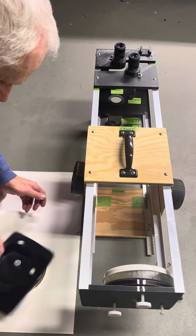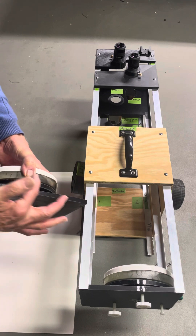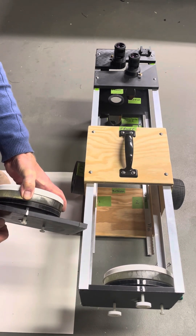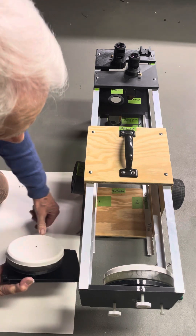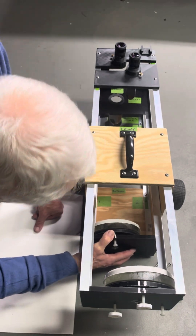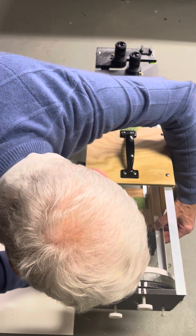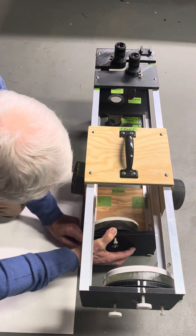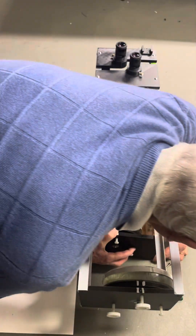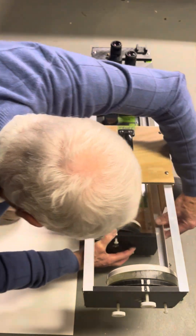The lower mirror extends about a centimetre out from its back plate, so you can see the screws are just about a centimetre out. The final adjustment comes when you're making sure the eyepieces are the same height and you're viewing at infinity. This installs the mirrors carefully in the right places and avoids damaging the mirror by dropping it.